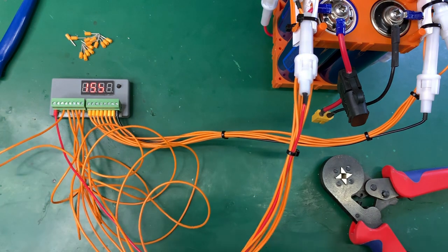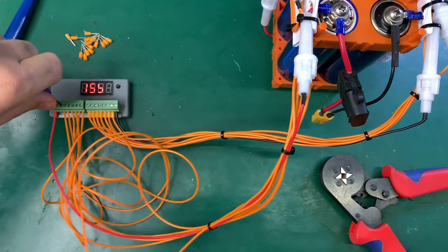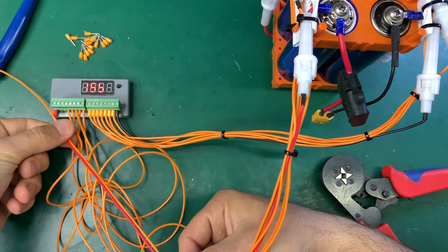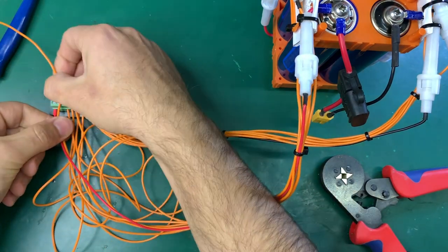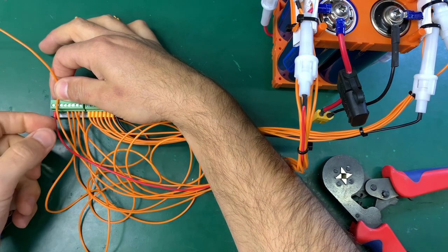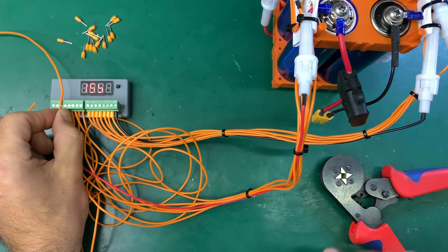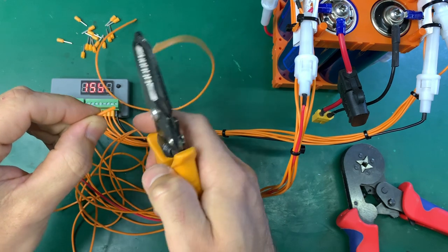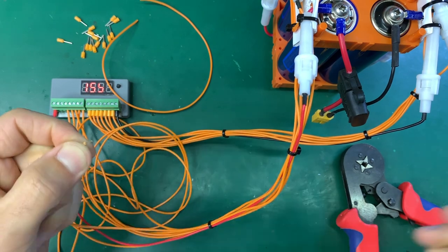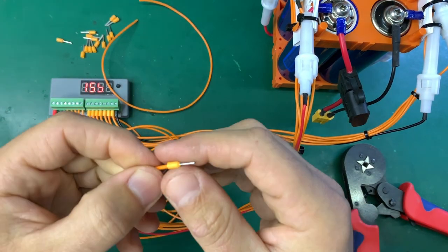Number 13 is really messy — spaghetti wiring — so I disconnect it and follow the red reference wire. I grab the wires with my hands to match the same length and look from the top to judge where to cut. I cut the wire and strip the insulation from the desired point, putting it all in place to get a nice snug fit inside the screw terminal.